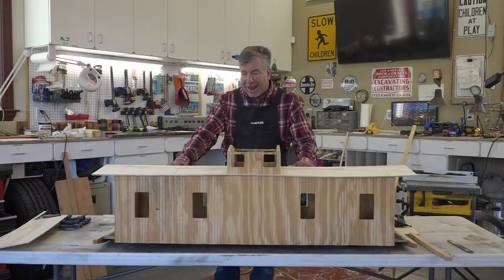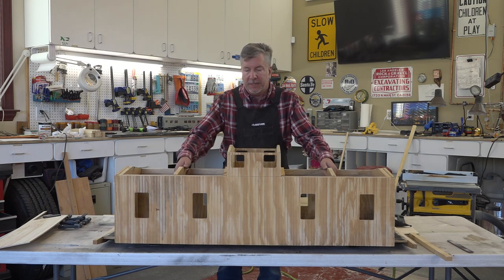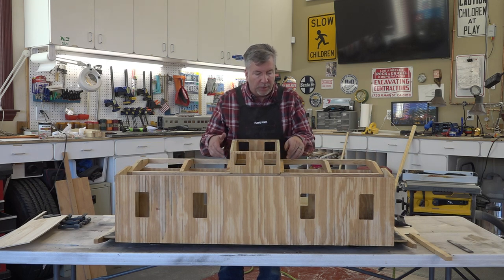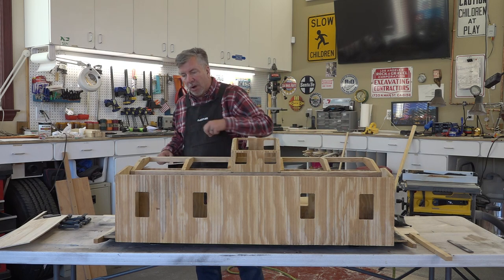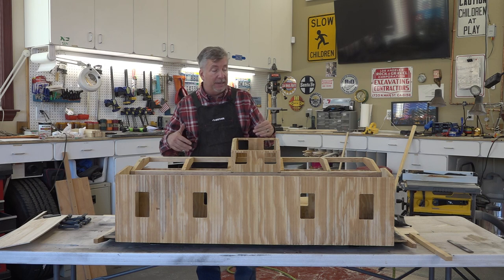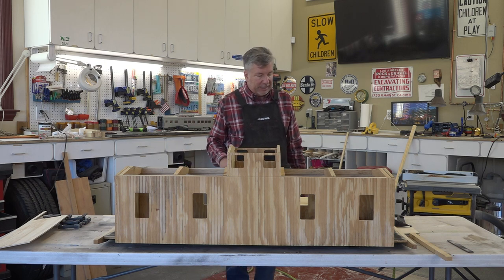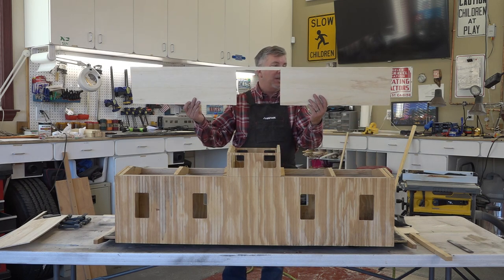We are back, and what we've done is on this roof here, we finished up this frame. We glued and nailed the cupola structure to the frame, and then we went ahead and put in the quarter inch by one inch little collar around the inside of the caboose here, and glued and nailed that. That goes ahead and holds this roof from going down too far so it sets in there perfectly. And instead of having two separate pieces of plywood for the roof, we went ahead and just got some quarter inch plywood.